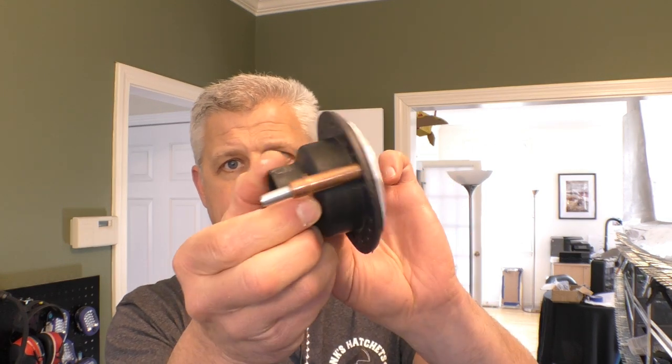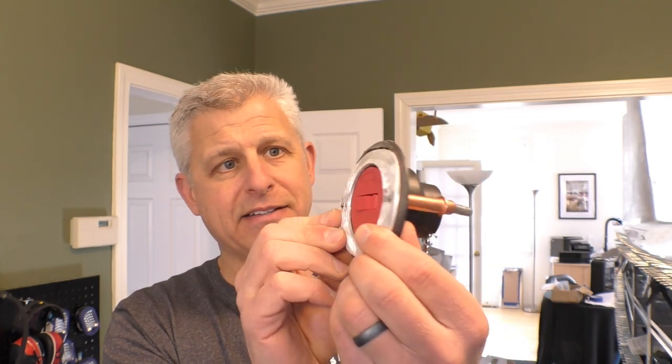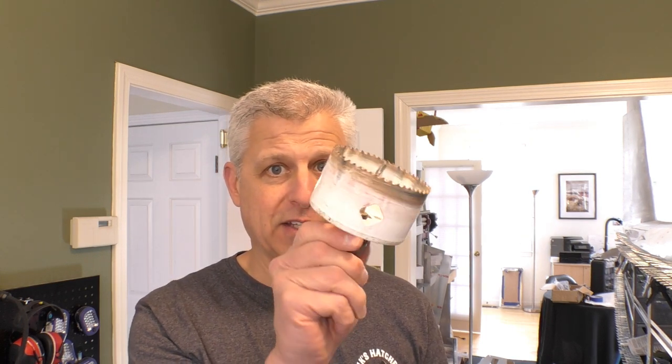All right, so I am done creating the shim now. It's got a nice bevel to this using this aluminum that's been milled down by hand to be this nice shim. Now it can go against that curved inner skin that's in the canopy skirt on the Mustang. The next step is going to be cutting a ring that'll be the outside trim ring. That way we're not just taking that super thin skin and putting screws in through it from the outside.